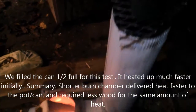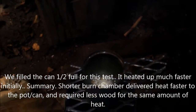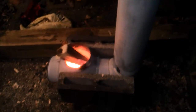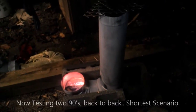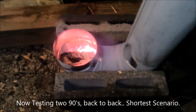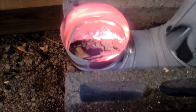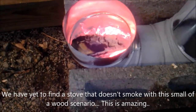It doesn't take but maybe two minutes to get water boiling, and that was half full a while ago. So anyway, 8-inch stove pipe. This is our next version of the rocket stove. We've got a 2-foot riser, and we're going directly from a 90 — we took the T off. Now we've got a 90 to another 90 to our riser. So back to a J.